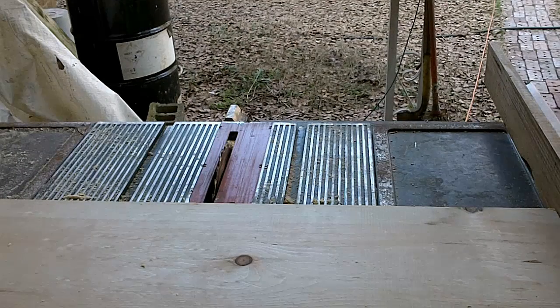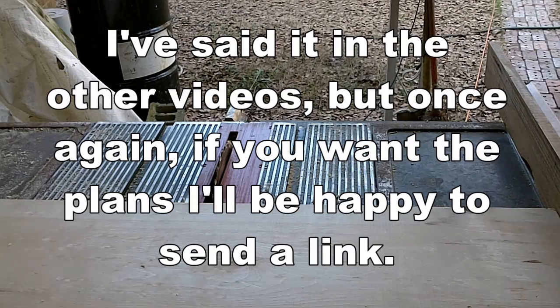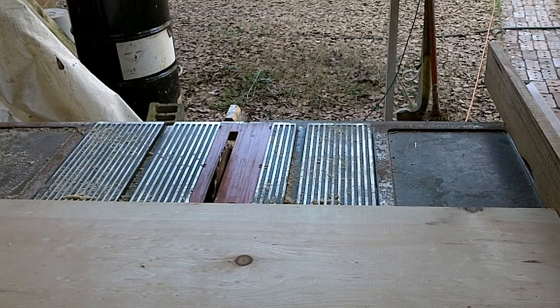Now I'm not going to dado these. These are just going to screw straight together like a square, and then I'm going to drop down some 3/4 inch. I ain't sure if I'm going to do 3/4 inch plywood or go ahead and put shelving in them. Probably do the shelving in those instead of plywood, and just stay away from the plywood altogether.